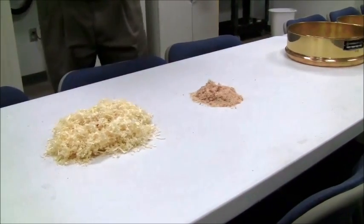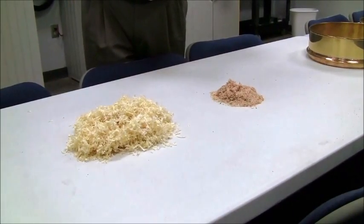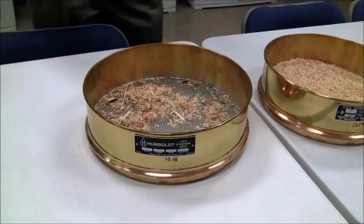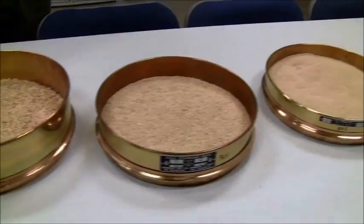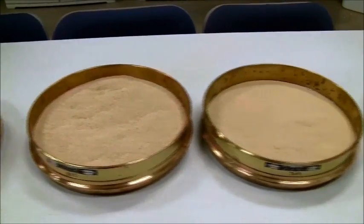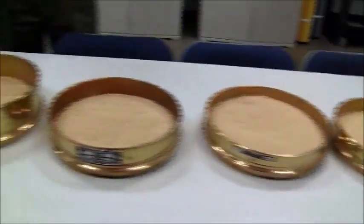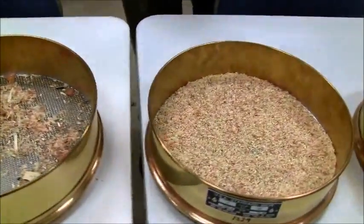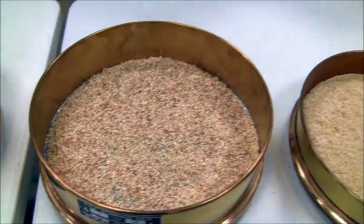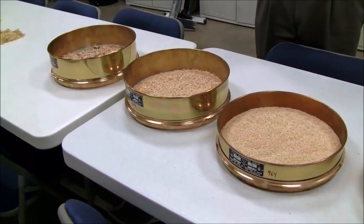On the other hand, looking at the sawdust pile, a lot of it may not explode. A lot of it is just too big to explode. So on the table here we have taken the sawdust sample and sifted it through a size-separating device. We have six different sizes. Starting from one end, we have some fairly large pieces, then what we'd consider chips coming off the saw. These three larger sizes will not actually flame up and explode when put in suspension.